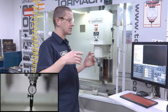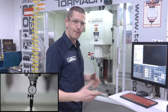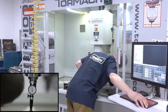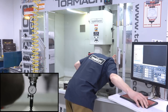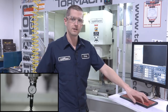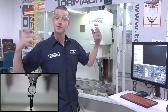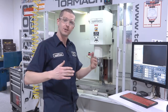That took 18 to get back, so let's see if we truly have eight tenths. Zeroed out — I may have started that first move with some of the preload taken out, which was my fault. Counting 18 steps, then 18 steps back — we're on zero. So we have eight tenths of lost motion in this machine due to the stiction and gib force. That's great. I'm okay with that. You can go look at your Tormach manual to reconcile this with the machine specifications and its capabilities. It's really easy to want to get hung up on some of these numbers, but we're here to make parts and get the most out of the machine.